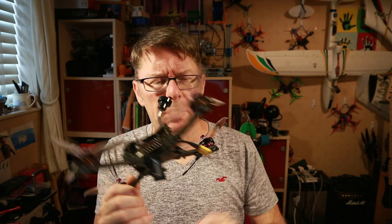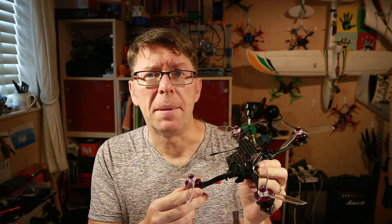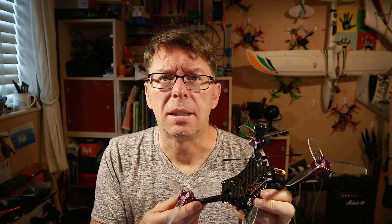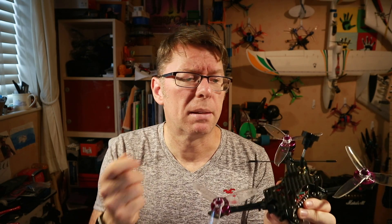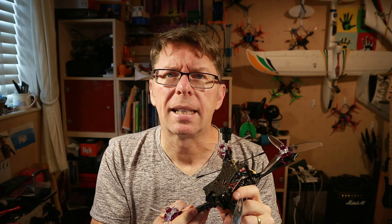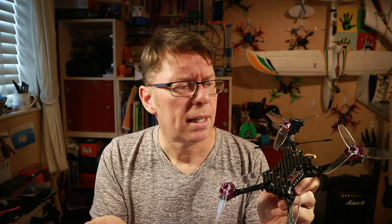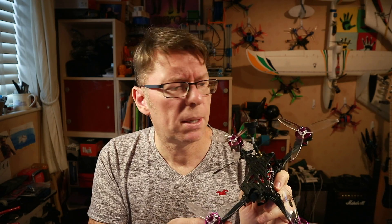As you can see, we've got the antenna — the one that looks a bit like the TBS one — and this has got an R9MM in there. I was hanging around because FrSky assured me months ago that they were going to update the R9 to allow over-the-air updates, so I didn't want to desolder it and then have to do it again. They seem to be doing ACCESS protocol and new things, so I thought: let's update the receiver and sort out how to connect up smart port telemetry to get data back to the radio.